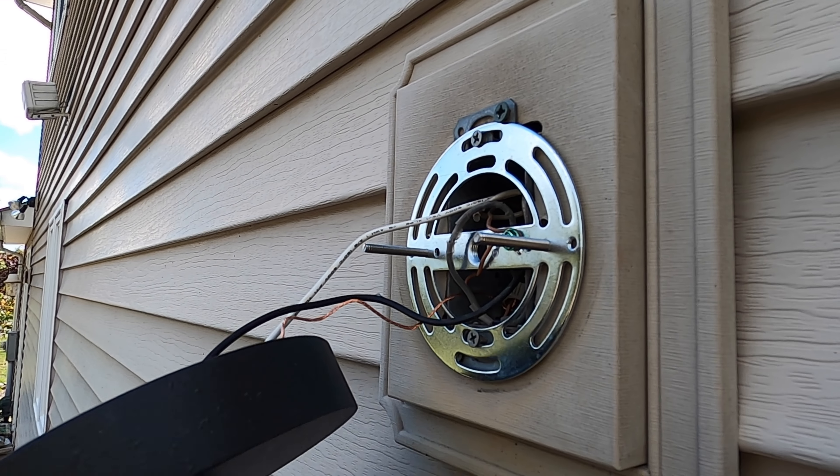The next thing we're going to do is reconnect the fixture. The power's been off since we did the removal, so that's already done. We have our wire nuts off and we're going to be working on the fixture next. I'll need those little mounting nuts I have here already. All the fixtures come like this with wires pre-stripped, but they're not twisted. So what I like to do is twist them good and tight so that when you put them on, it's more like a solid piece of wire.